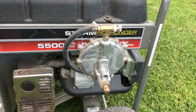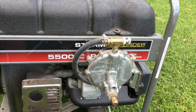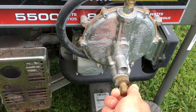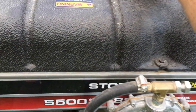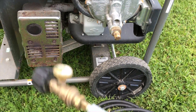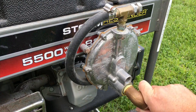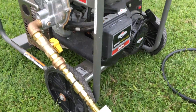I'm outside here with the generator. Here's my tri-fuel conversion kit — if you want more information about this, check out US Carburetion. I have a link below for that and also to another YouTube video. Right here I have a three-quarter inch to three-eighths flare and this is where my hose plugs in. I'm going to take that off and put the new line in — pretty easy to do. Here's the other end of the propane hose that goes into the cylinder.